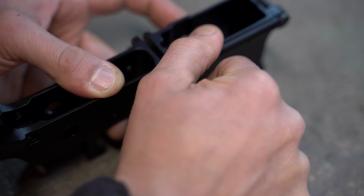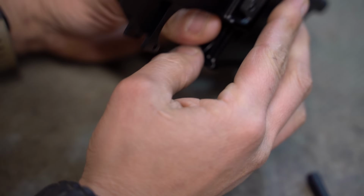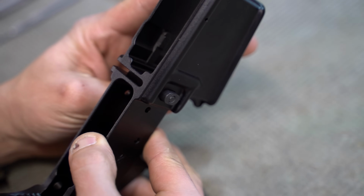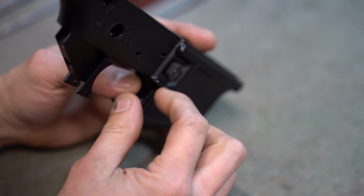But if you look at a forged lower receiver, you essentially have these three ridges around the magazine button. And the go, no-go with respect to Sons of Liberty Gunworks and the guns they're putting out the door is making sure that the button is slightly recessed from those ridges going around it. So it ends up protecting it. And you're like, oh, of course. But, comma, how many guns have you seen where that's not the case?